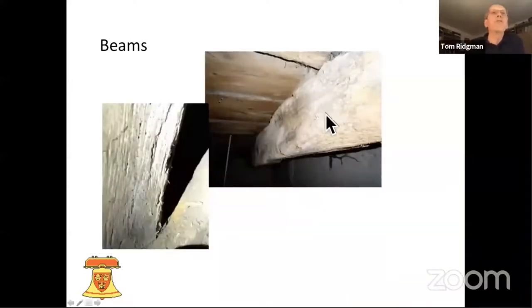This is one of the things we're looking for — this is all a bit rotten and skanky. Unless you've got a lot of experience, it's quite hard to judge whether that's good or bad. This one has a wedge in it, but unfortunately it's only got one — it should have two going in opposing directions. And this is showing you this yellow powder, which is a sign that you've got active woodworm going on. You need to get woodworm treatment and infestation people in. If you've got a lot of rot in your beams, you need a structural engineer or somebody experienced in old beams. I see how much of the beam is left by poking it with a knife.